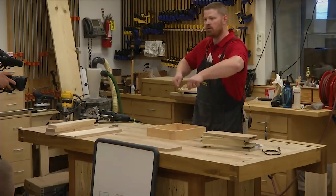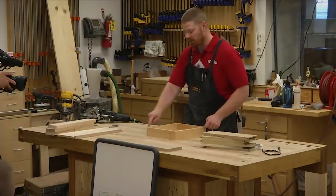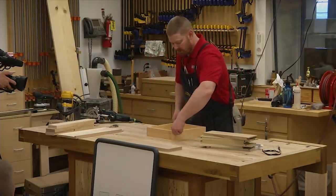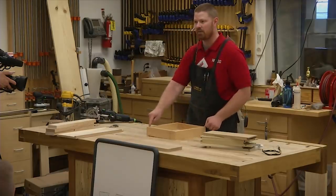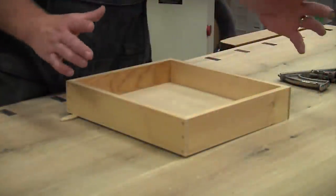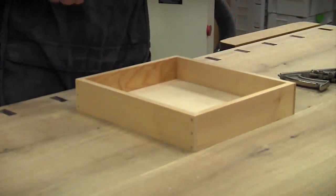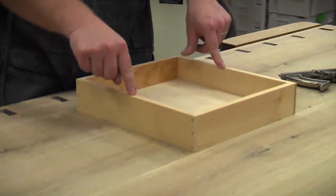What you do is you pull those two corners high. So you end up with a drawer that's tippy. So I'll just stick this in. So let's say I pulled those corners up. What I did was I just made it do this. I didn't pull it into square. What I did was I pulled those corners high, and now the drawer isn't sitting flat in its opening.